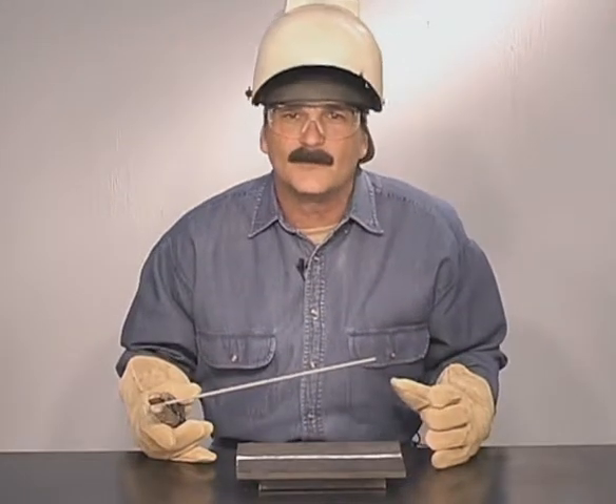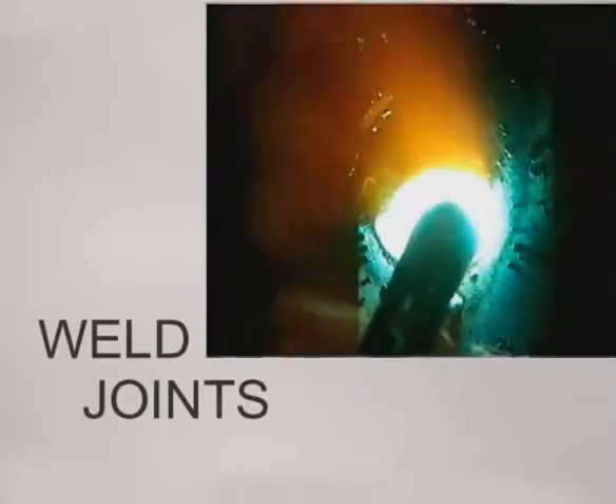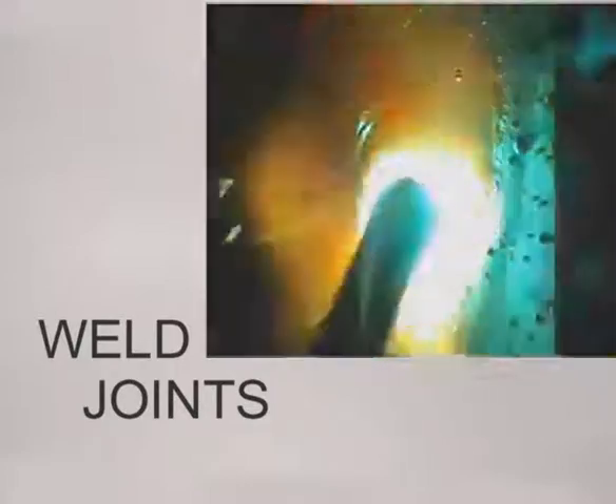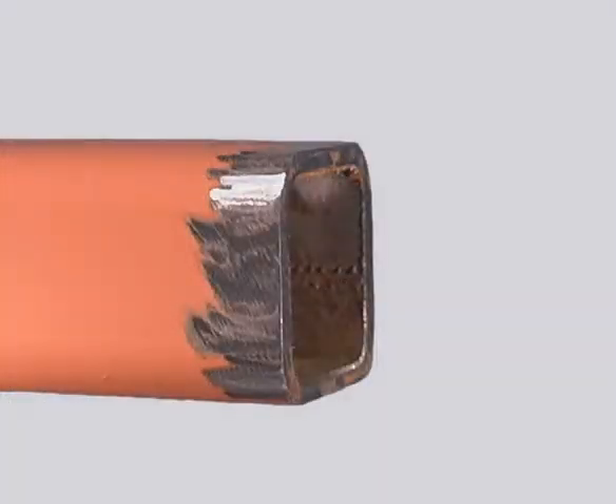Okay, let's take a look at putting two pieces of metal together. The first steps with any type of weld joint are metal preparation and joint fit up. If you're working with new metal, most of the rods can handle the mill scale, which is a dark layer on the surface. Use a grinder to clean any metal that's rusted or painted.